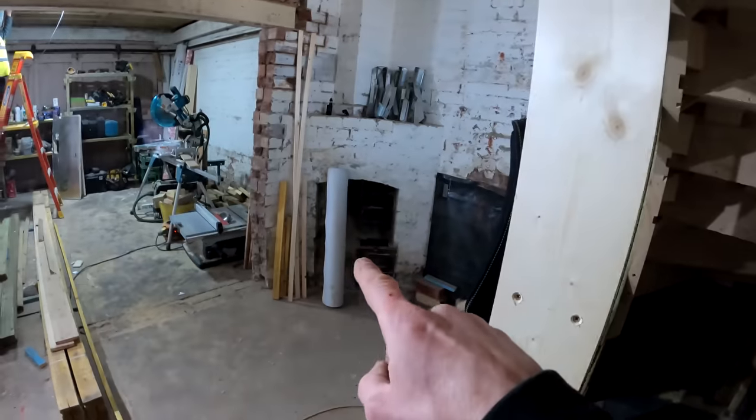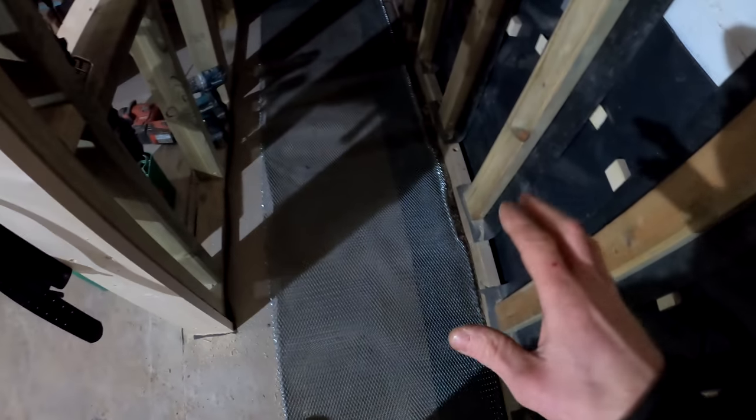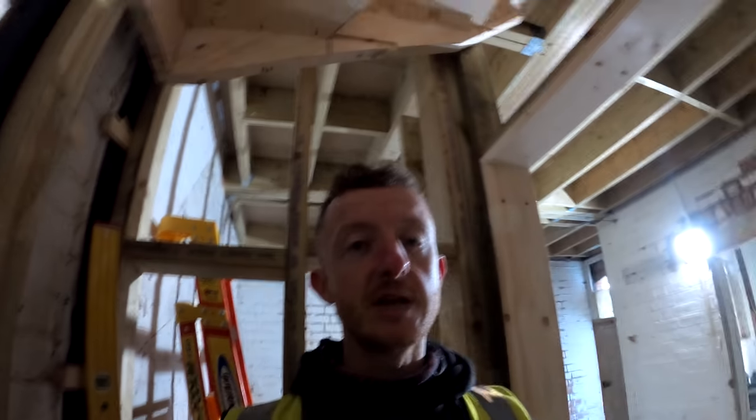Next up, what I'm going to do is get this mesh, this plaster lath on the underside of this staircase. What I'm going to do is use some roofing felt, some membrane, and put that on here first, and then put the mesh over the top of that. The reason being, if you've ever used this stuff, it's great, but if you're doing something overhead, actually trying to get the bonding to stick into it is a bit of a nightmare. So if you put that on the back first and then go over this, it gives the bonding something to stick to, so you can push it through and it's less likely to fall out in your face. Because nobody likes plaster in their face - that is my next process.